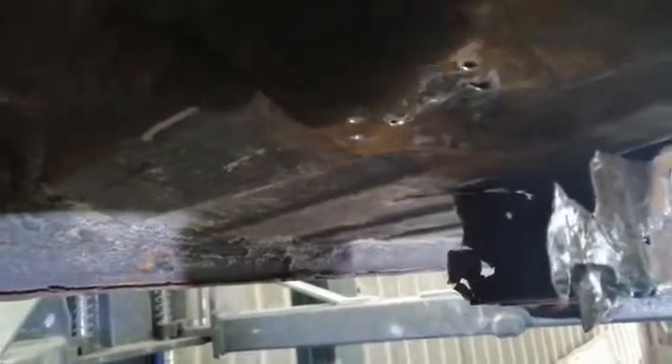Areas that will catch you out: it is spot welded in the footwell at this point here, and that's all that's connected on that top part. I drilled from the top but I still found I had to have a hacksaw blade in here to try and free up the last few connections that have been made as part of this spot weld.